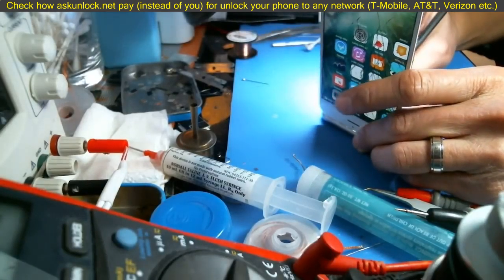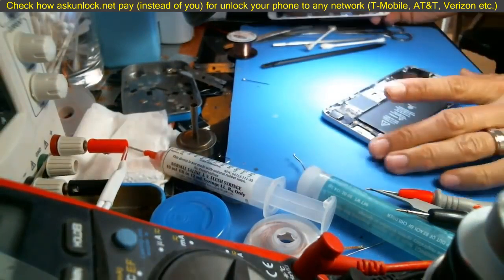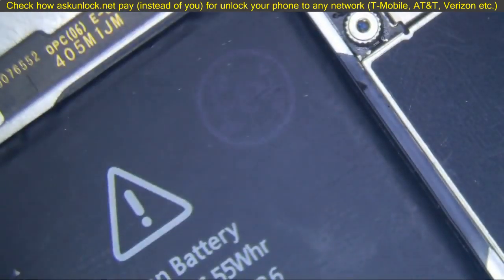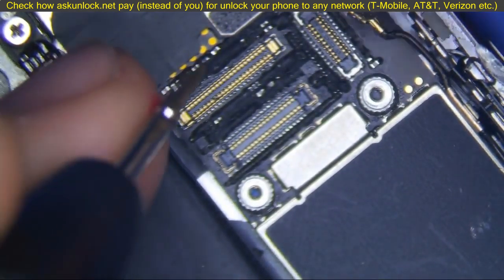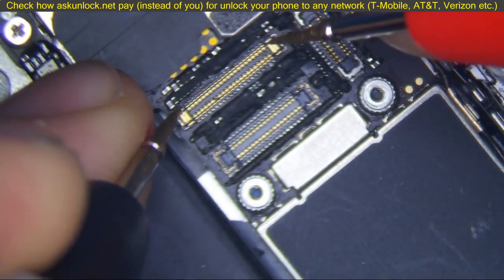All right, so the screen is on. I just lifted the connector here. Okay, and let me switch to my microscope. All right, you know what? I wonder if I can. No, I can't. I was gonna show you my multimeter as well, but you guys would just have to trust me on this. Alright, so I'm going to put my multimeter to voltage mode here, and I am looking through my microscope now, and so what I'm going to do is measure some voltages to the backlight.